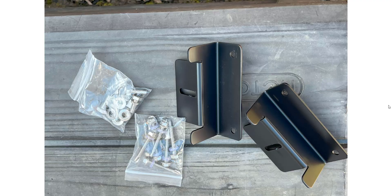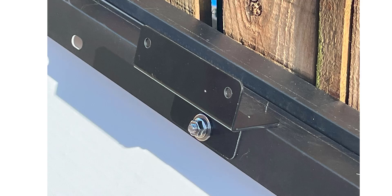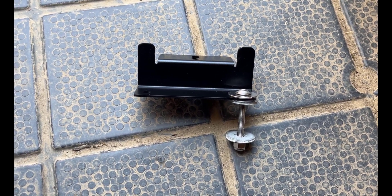In terms of mounting solutions, I looked at a couple of different types. I was going to use a traditional rail mount, but that leaves a lot of space between the rail and the solar panel where birds can nest, requiring extra bird-proofing. Instead I found these — called solar mounting feet. What I like about this product is it's very low profile, so no birds can get between the solar panel and the roof. You get four in a pack, mounted on both sides of the panel, which should be more than sufficient. You just screw them through the holes along the solar panel frame with a bolt and tighten with a nut, leaving a surface to mount onto your roof.